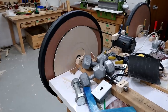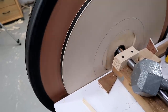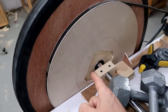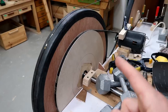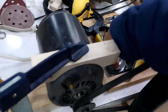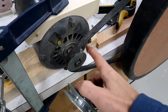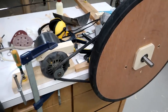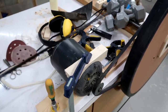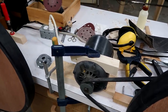One astute observer asked about getting the pulley centered, and you can see this is not precisely centered — it's probably about a millimeter off center, something I still need to work on. For truing them up at low speed it doesn't really matter very much; this is running at maybe half the speed I want to run it eventually. I'll probably use this pulley, which is almost twice the size, or I might make an even bigger wooden pulley. By the way, this motor is from a 12-inch Craftsman bandsaw I decided wasn't worth fixing and threw off a scaffold some years ago — it's a two-thirds horsepower motor, so that's not too bad.